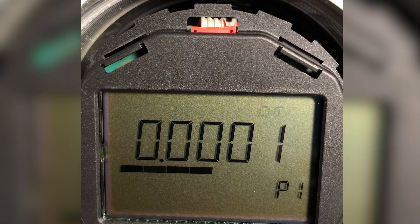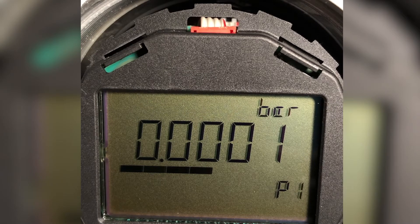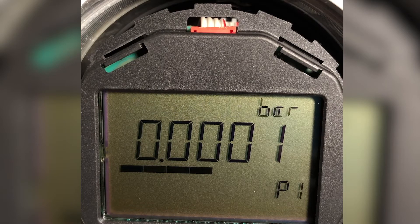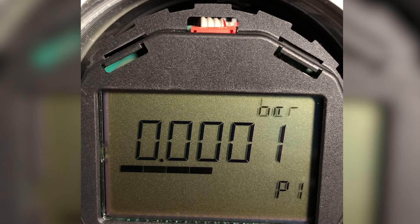In order to avoid any confusion, I did a factory reset, which is parameter 35 — FACT for factory — and it gets you back to the standard factory conditions. I see this transmitter in the factory reset as measuring pressure, and the units of pressure are bar.